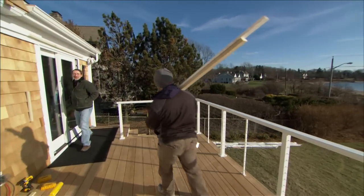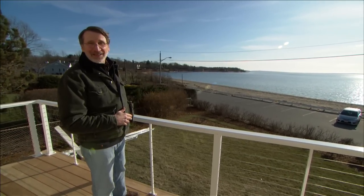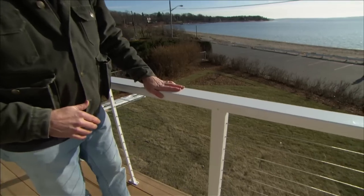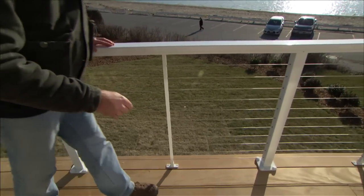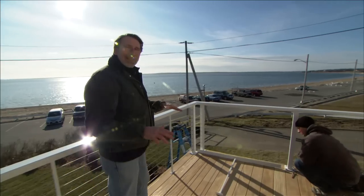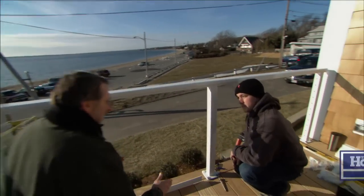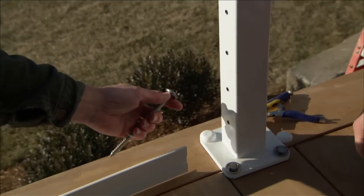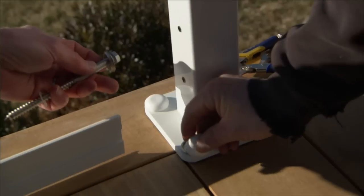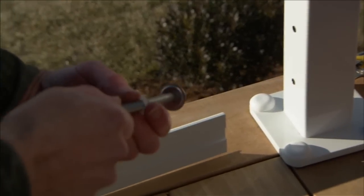The last detail on the deck is the railing. The architects specified a cable rail system, which is perfect for this location — you don't want to block that great view. The system is made up of powder-coated aluminum: posts, rails, pickets, and cables. The manufacturer sends components a little bit longer and they're fit in the field. Chris secured the posts using a six-inch stainless steel lag bolt that ties down into the PT framing. There's a Teflon washer to separate the stainless steel from the powder-coated aluminum to prevent corrosion in the saltwater environment, plus a white plastic cap that snaps in place and hides the bolt from view.